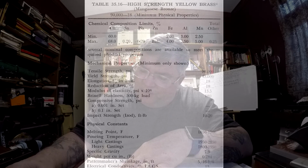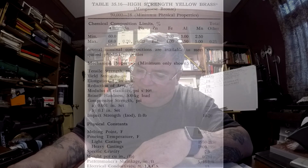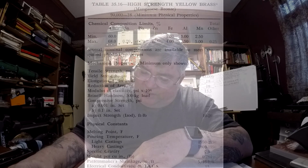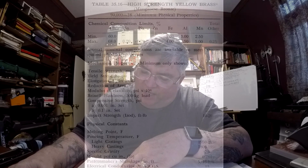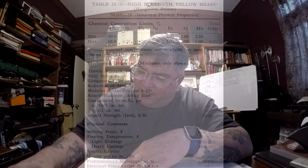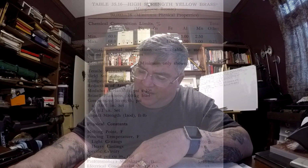In casting manganese bronzes, the molding sand has properties in which a considerable latitude is permitted. The film of alumina carried on the surface of manganese bronze gives a fair finish even in rather coarse sand. Generally speaking, sand with permeability of 40 to 100 and a green compression strength of 8 to 12 psi is usually satisfactory for most casting operations. It should be mentioned that the alloy is quite susceptible to damage by excessively wet sand. Consequently, the sand in the foundry should be worked slightly on the dry side.